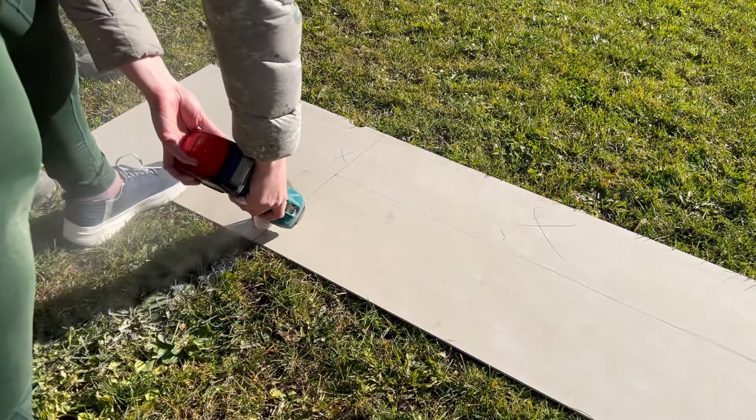I had the laser level set up to make sure the top of the first line of tiles was all level, and once I got that level line I marked it out and then used my other level as a ruler to rule across and make a pencil line — which is going to be the line where I know my tiles need to sit flush. The first line of tiles around the vanity needed to be cut down to size. I got those all cut down and installed, and then moved back over onto the shower side and finished off tiling that wall as well.